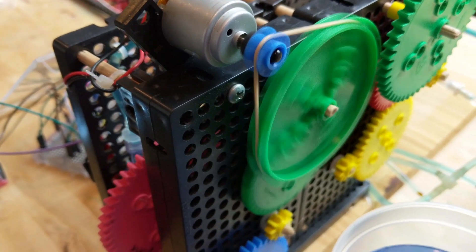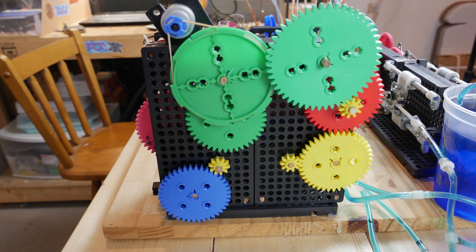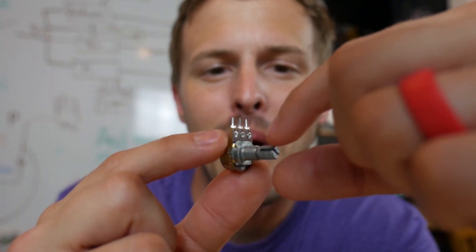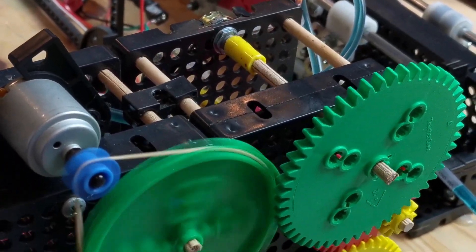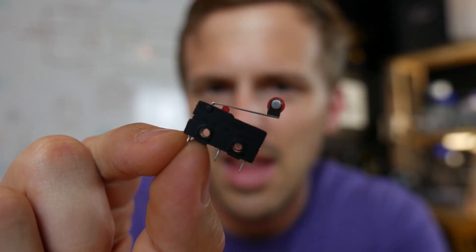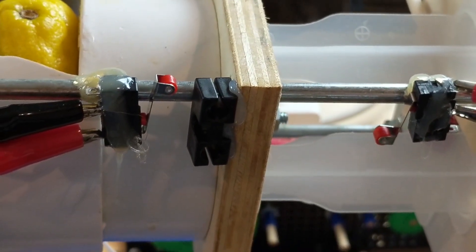We also needed a little contraption to make the crusher go back and forth — that's what this guy is. It's basically some water valves inside of a frame with some gears attached so that when you spin this little electric motor the valves turn one direction, and when you spin the motor the other way they turn the other direction. To tell the microcontroller where the valves were, we used this potentiometer. A potentiometer is a little electrical device that as it turns makes it easier or harder for the electricity to pass through it. And the last piece of the puzzle are these little limit switches that tell our crusher when it's gone all the way in one direction or all the way in the other direction.